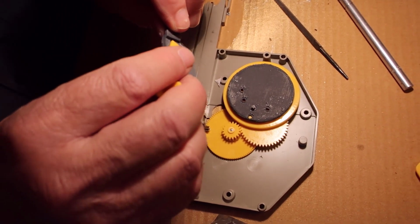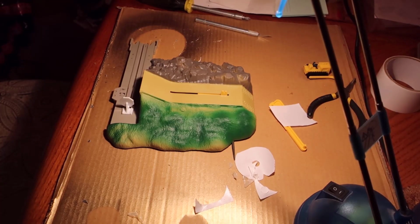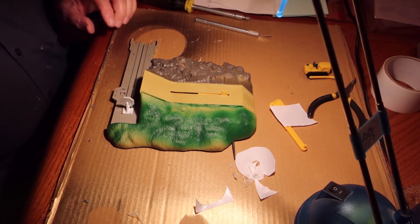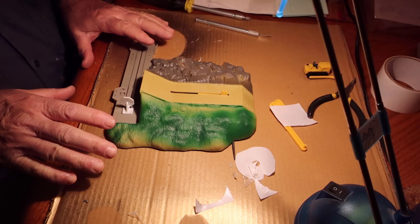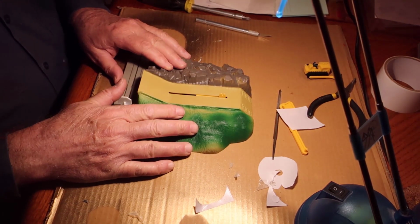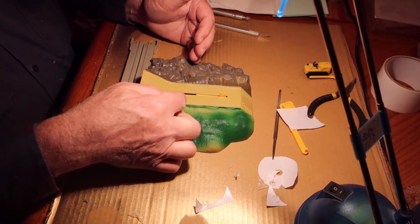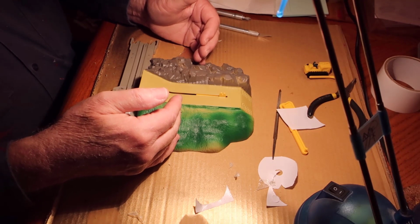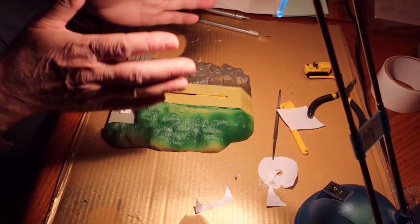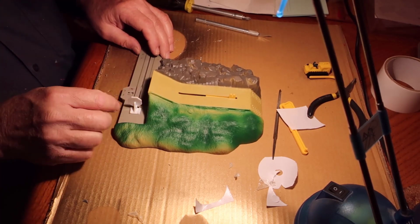I've got to sand this so that this slides a little better. Okay, we'll stop the video. Okay, off camera. I reset this, and using the laws of levers, brought the rotating pin 180 degrees away from, or totally opposing, the pivoting pin, and then set the axle grabber on it and dropped this in using the index over here and this parallel front and got it on the right time.